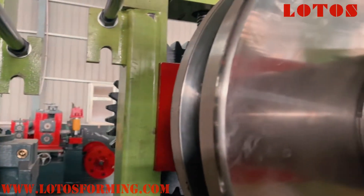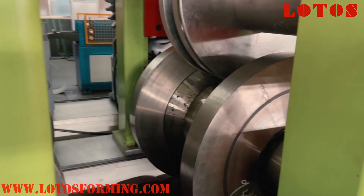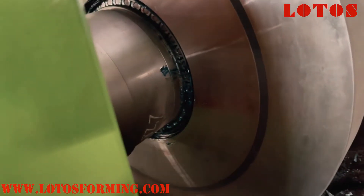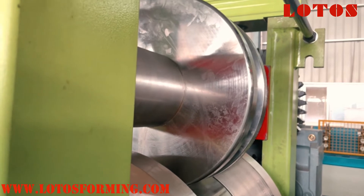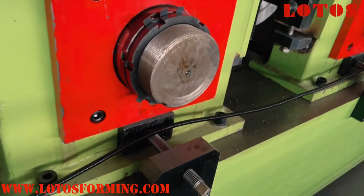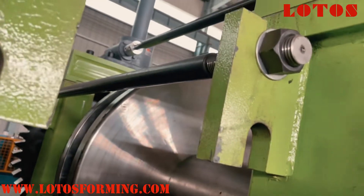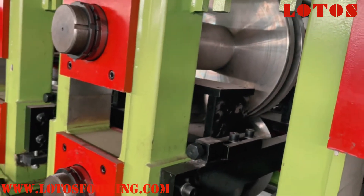The biggest roller — one unit — is up to around 600 kg. This is the roller and how it is united with the bearing inside. This is the up roller and down roller. We also have this lock unit to make sure the stands will be firmly in place, as well as reinforcement on two sides of the stand to add strength to the machine.